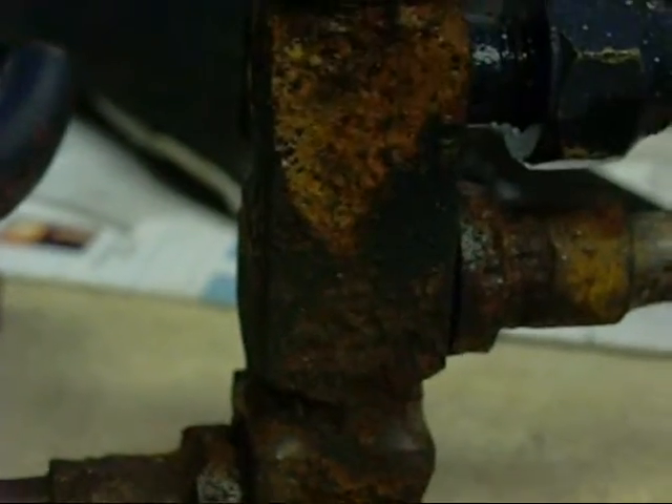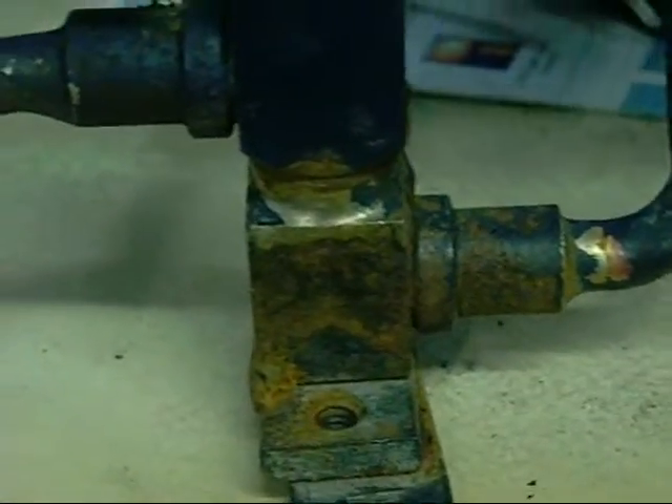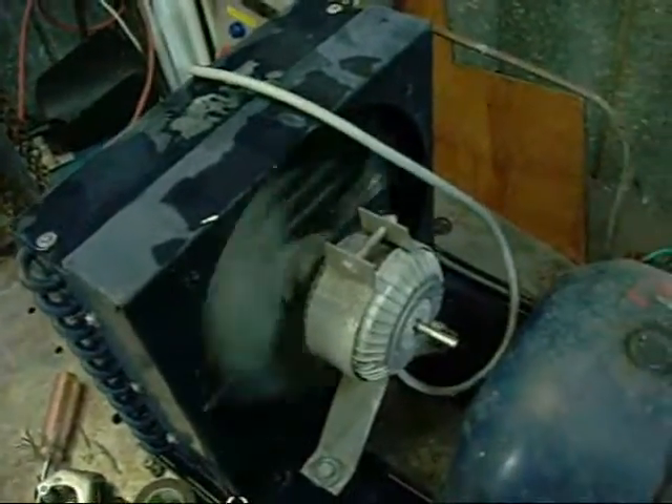Where's the old king valve? The thing's been sweating constantly when the unit was running. Don't drop the new one. It was leaking in there — I thought the bandage was covering it up but it actually rusted through. Yep, that one's stiffed. And that's the used replacement. I'll wait till I get an oxy set and another replacement dryer before I do any more on this one.